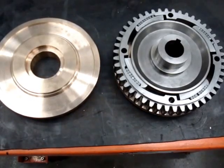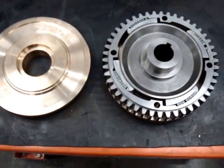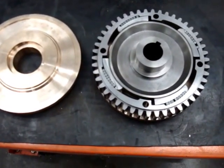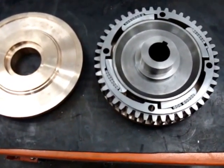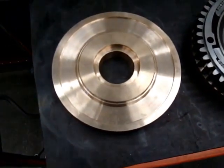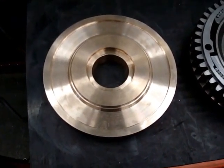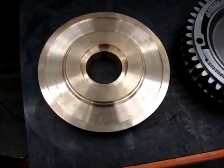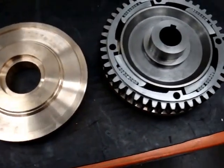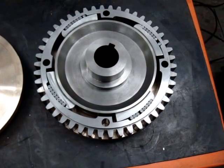This is the clutch for the full-size 1867 Otto Langen reproduction. On this very earliest version, Otto decided to use solid bronze covers for the outer jacket of the clutch itself, and they serve two functions: they retain the shoes and the rollers in the clutch, and also act as a bearing centering the outer gear onto the inner core of the clutch itself.